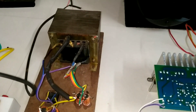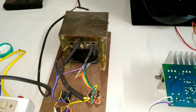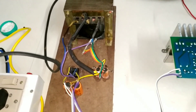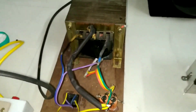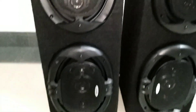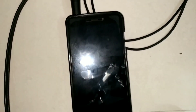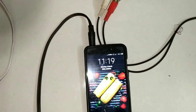We can use the whole box in the port. We can use the power supply. It is a 24-0-24V, 7A transformer. We can use the 10A diodes and the 2200 microfarad, 80V capacitor. We can use the power supply suited to this setup.